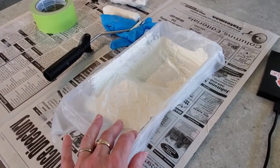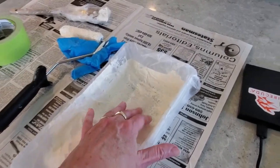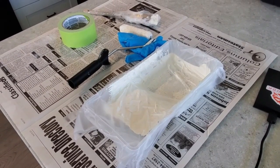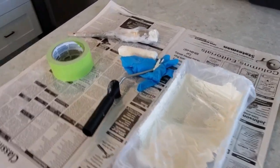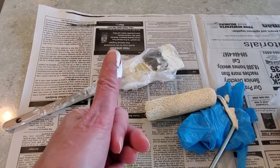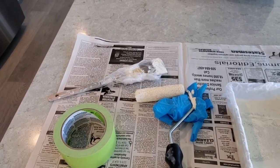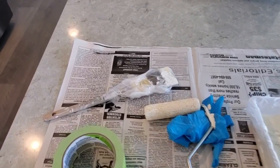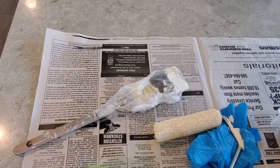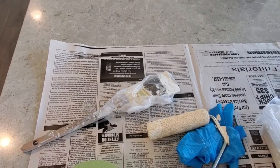If you've ever tried this trick — you put plastic wrap, cling wrap, inside the tray and try to suck it into the tray. We need to wait a couple of hours before doing the second coat and I didn't want to waste another tray. I also wrapped the brush in the same manner. That keeps it moist. With brushes, if it's going to be more than a couple of hours — even days — you can put them in the freezer to avoid having to wash them. Washing and letting them dry is probably the better way, but just thought I'd share that hack.